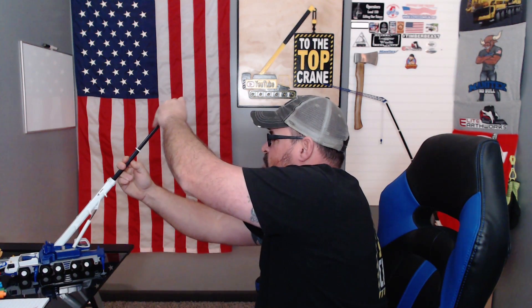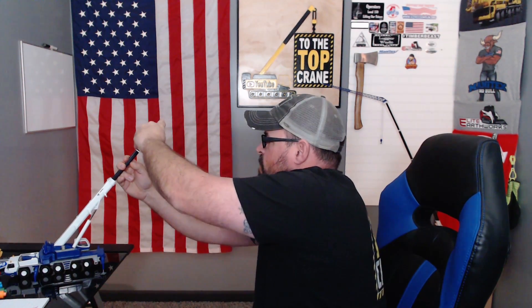The way these sections are numbered, at least on the Tadano, section 5 is the smallest, and then it counts down backwards until you get to the biggest movable section, which is section number 1. This is the configuration I typically have it in when I'm setting the crane up — 71.9 feet of boom, section number 5 at 93%. Now, I can also get 71.9 feet of boom by configuring it differently, with section 5 at 50% and section 4 at 50%.